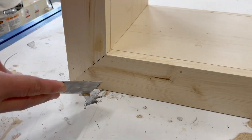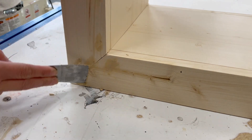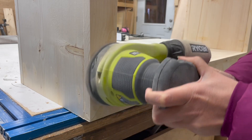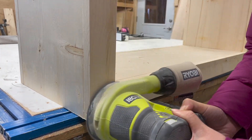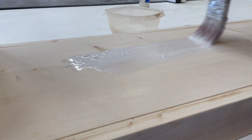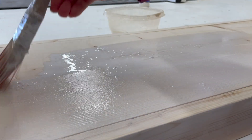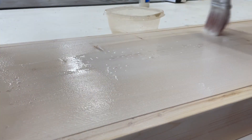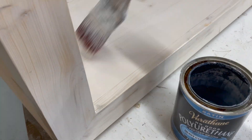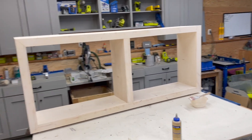This is such a beautiful project. I really took a lot of extra time and care to make sure it's perfect — it's a piece that is going to be kept for a long time. The nail holes I filled with wood filler and then I sanded the entire project with 120 grit sandpaper. Sanding is extremely important for a professional looking finish. Then I used some watered down white paint to add some white color to the wood, and once that was dry I touched it up with a clear coat so it gives it that bleached wood effect. So pretty!